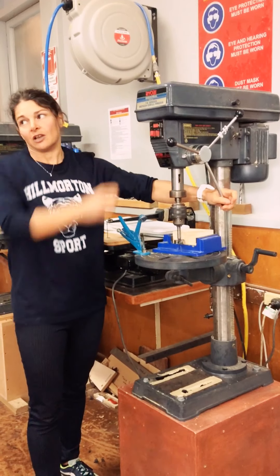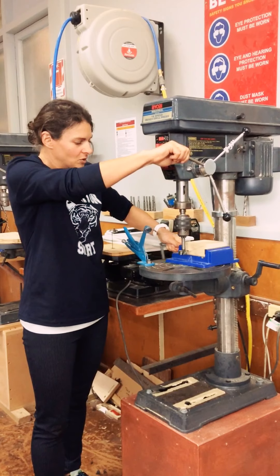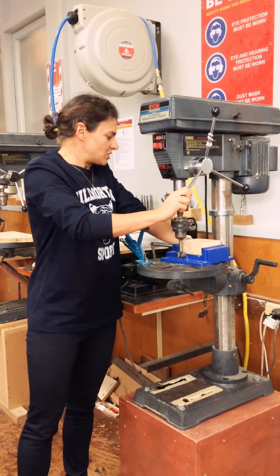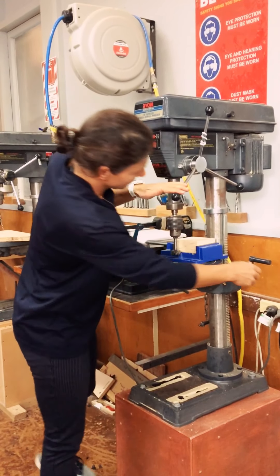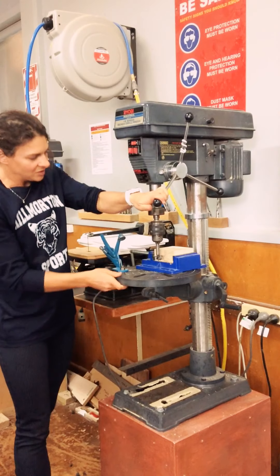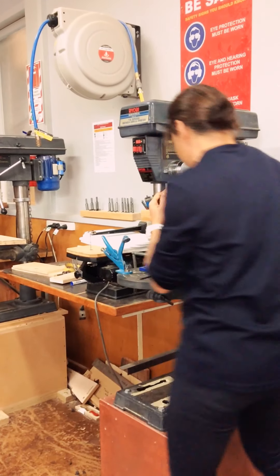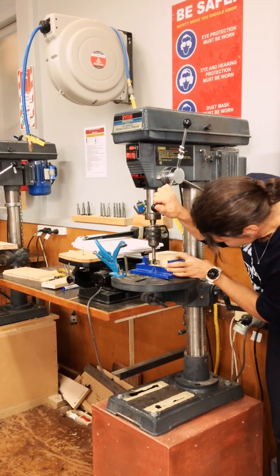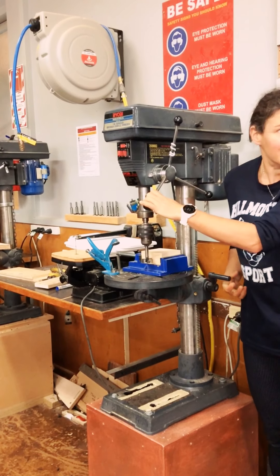On some drills, there's a little lock at the top that we just set. But on this one there's not, and it's allowing me to go to there. So what I need to do is undo this quick-release lock on the side to change the depth on this one, and then wind the handle down so that the machine bed drops to the height that I want. And I've got to wind it back up — you might go a bit up and a bit down, but if you don't set the depth on this it's going to be pretty tricky to stop your tool where you need it to stop.